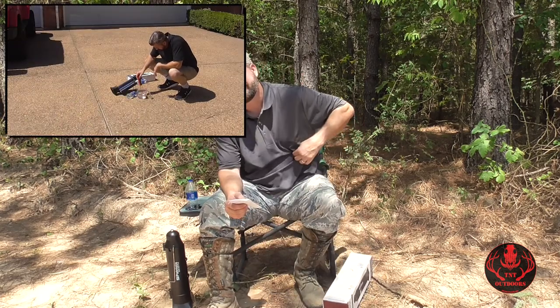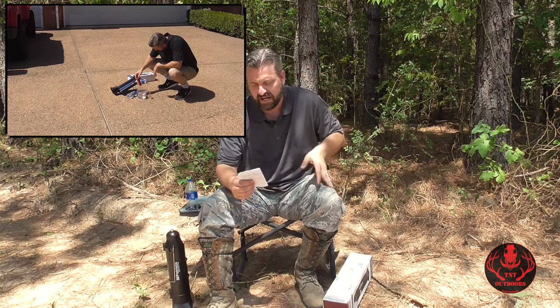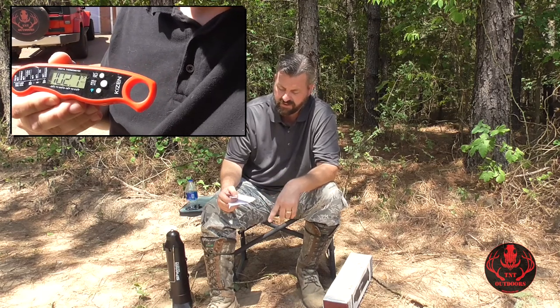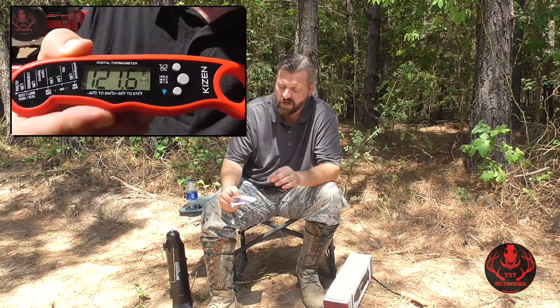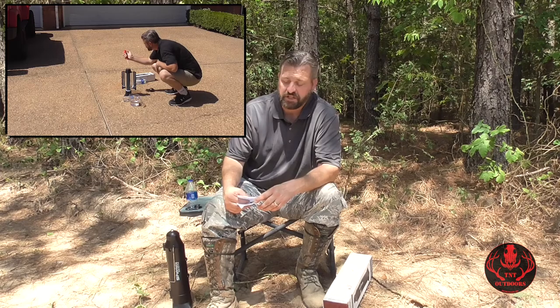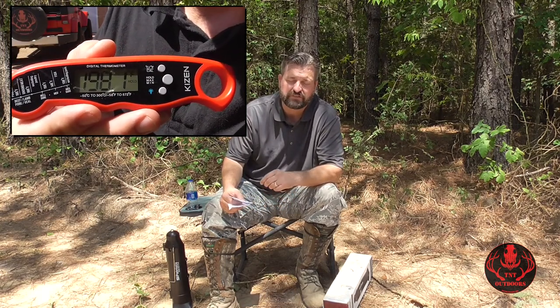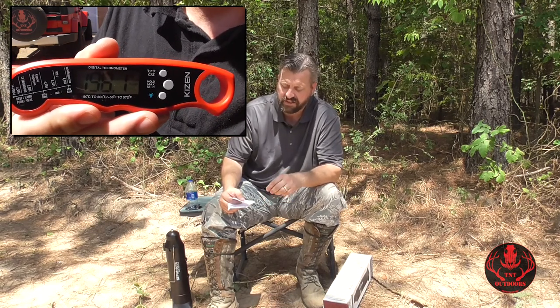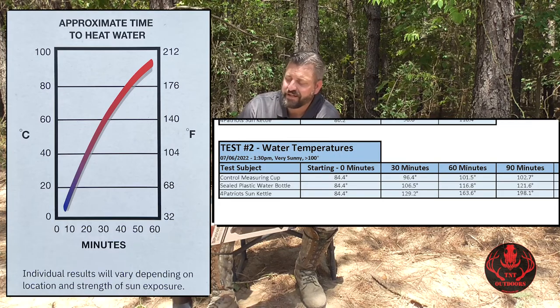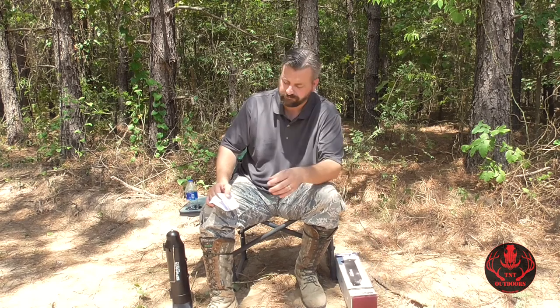We kept testing to see how hot it would get. After 90 minutes on the over-100-degree, cloudless day, the open-air cup reached 102.7°F and the sealed plastic bottle reached 121.6°F. The Sun Kettle reached 198.1°F at the 90-minute mark — close, but still not over the 200-degree mark the chart claims would be reached after only one hour. On what I consider to be a perfect testing day, an hour and a half still didn't get there.